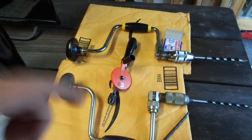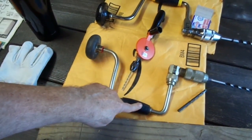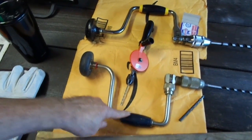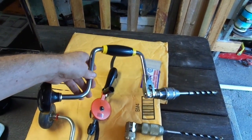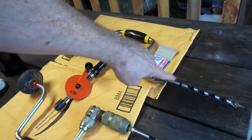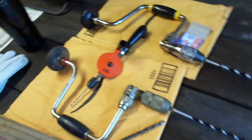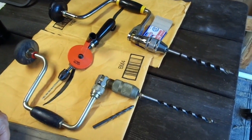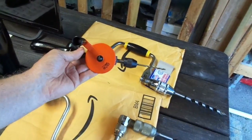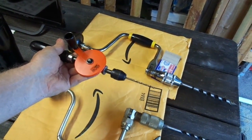I've got some various tools here. Two of these are a brace and bit — auger brace and bit. This is an old classic one from the 1960s; this is a Stanley. You can get these on eBay, probably in the range of $20 to $30. This is a newer one made in England — it's got four sets of tabs to hold the bit in place, so you can use conventional bits, whereas the old-style brace only had two tabs and requires special squared-off, tapered bits. And then this is a Schroeder egg beater style — about $32, made in Germany. Pretty good quality. You can drill up to about a quarter inch. I've got a 1/8-inch bit here, and we're going to try these out today.